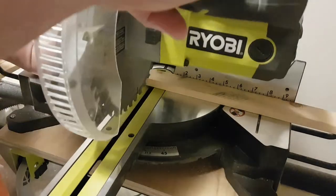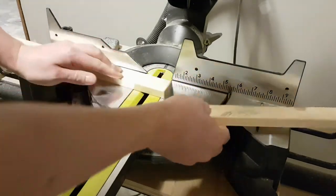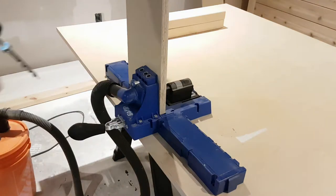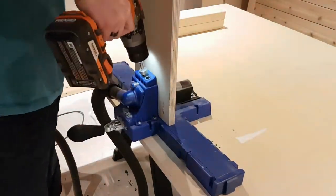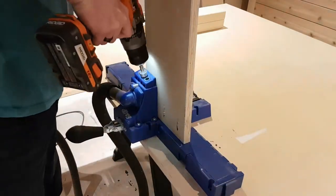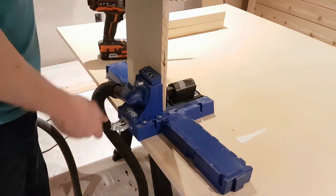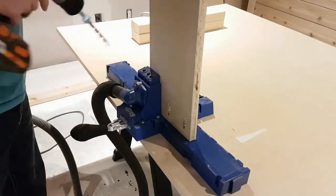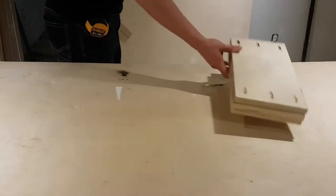The reason I'm doing this is because I just didn't want something to be so slab-sided. You can get some really good custom looks with actually the simplest of techniques. From there, go ahead and drill some pocket holes into the plywood panels to attach them to the legs. You can use whatever joinery method you want, but pocket holes are the quickest and easiest and a lot of people can access them. I'm just using my Kreg jig — big one or small one, doesn't matter, you get the same result.